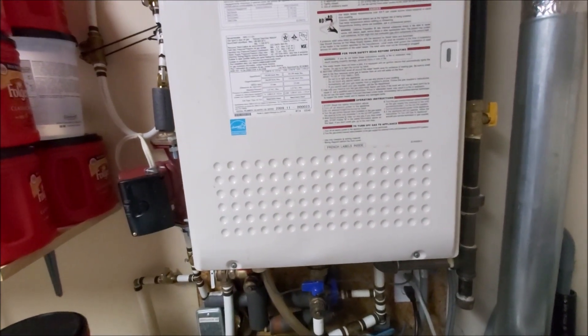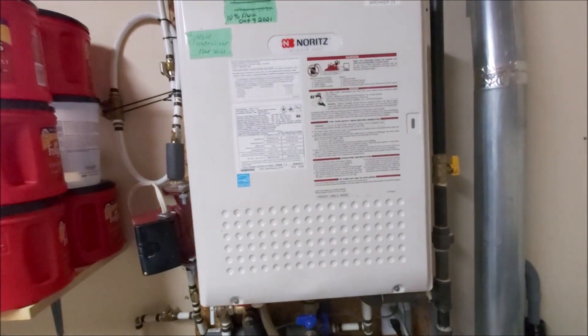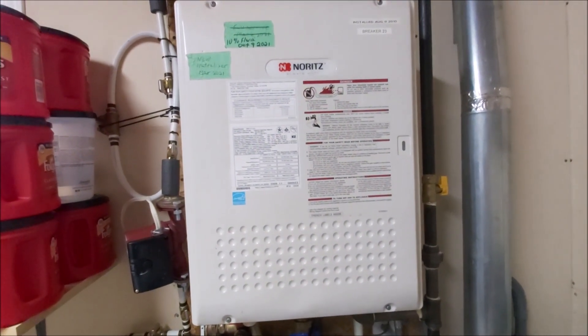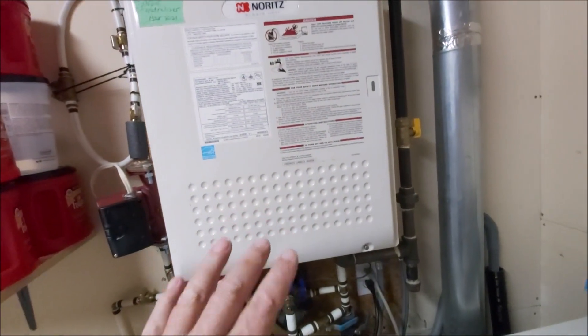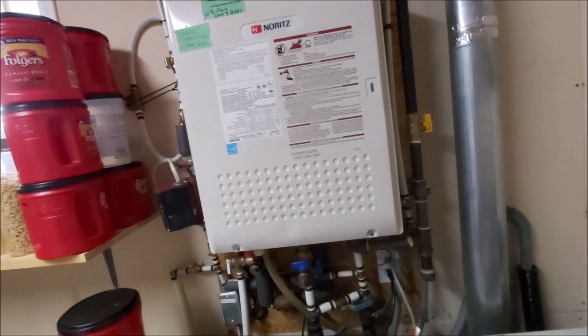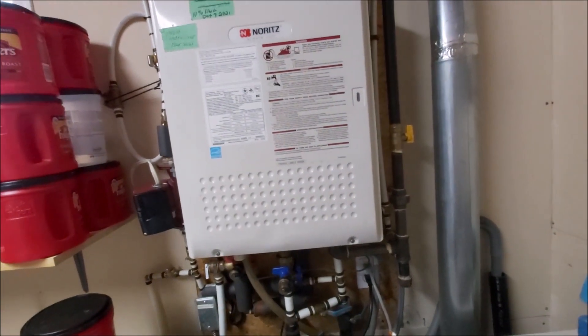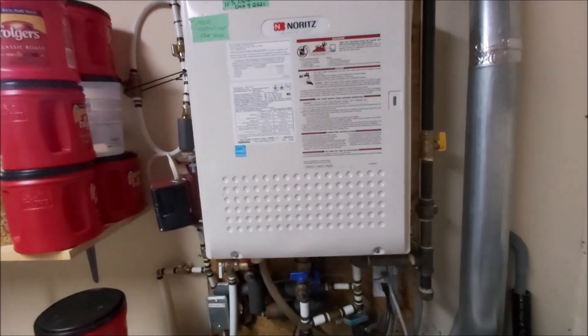If you preheat the water and it's at target temperature, the incoming water at target temp means this tankless won't even fire. If it's a little bit colder than target temp, no big deal — this will fire and maintain that temperature. I could set that hotter; I have this calling for 50 Celsius upstairs. If I set the preheat to 52 or 54 Celsius, the tankless won't even fire if the water is preheated, so I'd be saving on natural gas and whatever power the tankless consumes. This runs on solar when I'm exporting more than I'm importing — genius.